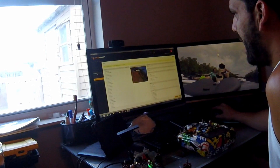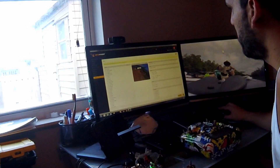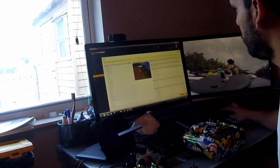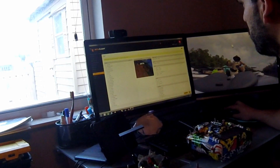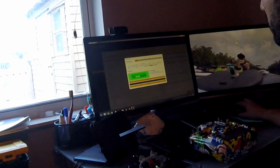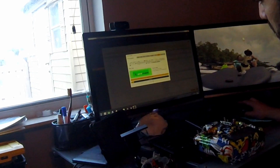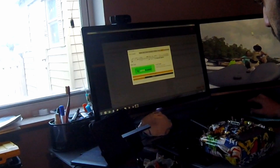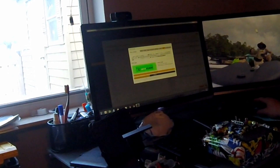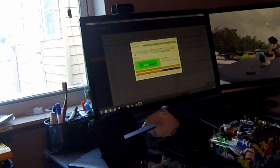I'm going to go to my OSD and turn on the RSSI value as one of my active elements, dragging it up next to my main battery indicator. I'm also going to change my font by clicking on font manager at the bottom right and clicking on clarity to make the font bigger and easier to read. Click on upload a font after selecting clarity, and it will start uploading that font. When it's done, hit save. Then I'll run a little test to make sure the OSD is showing up.